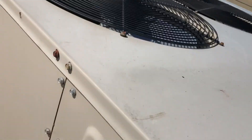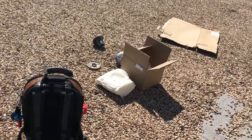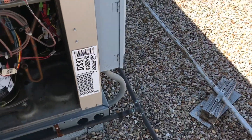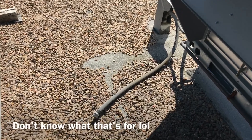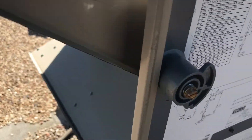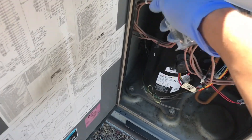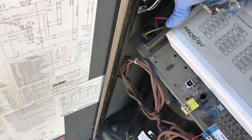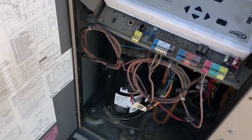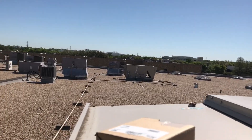When I first saw this I didn't know if I had to bring my computer up to connect it to the USB, but that's just to save profiles — so you can pretty much profile another unit the same way. Got that new motor in place. I just wanted to see where it shorted out on the inside — the motor relay. New relay, new first choice capacitor right here. Looks like a tight little spot, but let's get this unit up and running, then go replace the enthalpy sensor for that unit.